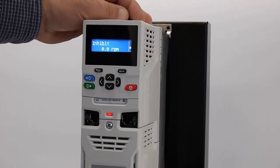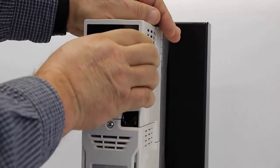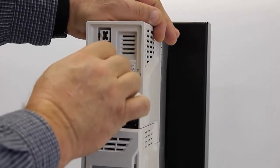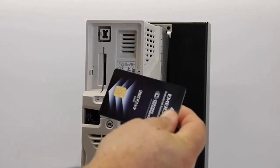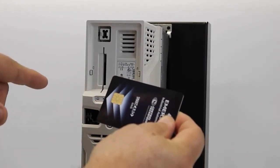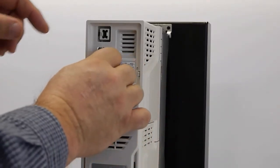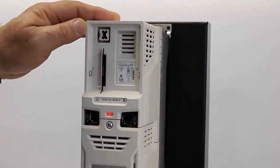I'm going to demonstrate how to install the smart card. It's located behind the keypad, so the first thing I'll do is pull the keypad off. To do that, you just grasp both sides of the keypad and pull it straight towards you. It takes a little bit of effort, but it comes off. Notice the smart card has a piece of gold foil and arrows that point towards the front of the card. The way to install this is to make sure the gold foil is always facing the left side of the drive as you're looking at it, and the arrows point towards the back or the heat sink of the drive. So to install it, I'm just going to slide it into the slot. Make sure it's fully inserted — you'll feel when it ends back there. And then I'll plug the keypad in again.